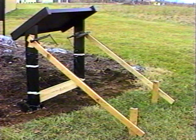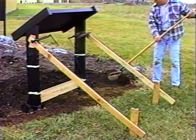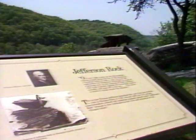The eighth step is the last. After the concrete is set, remove all bracing. Wash the exhibit with a cloth and clean water. Cover the exposed concrete with soil or other suitable material. The installation is now complete.